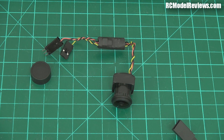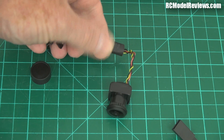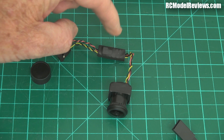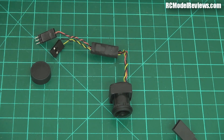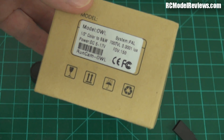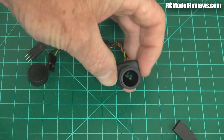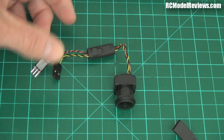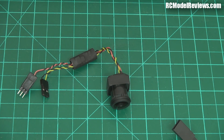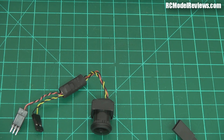This comes with a little external piece and heat shrink — it's actually just a voltage regulator, a UBEC. This will run on 5 to 17 volts, so that's a maximum of four cells — basically two to four cells, which is probably all you want on something like a mini quad. It also comes with a lens cap, which is bigger than a normal lens cap — won't fit a standard one because that lens is way bigger.